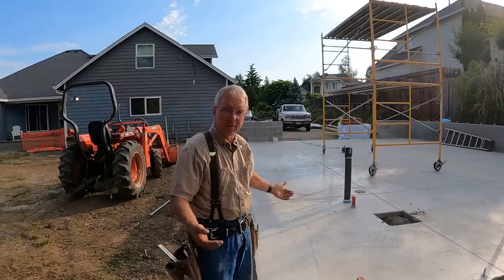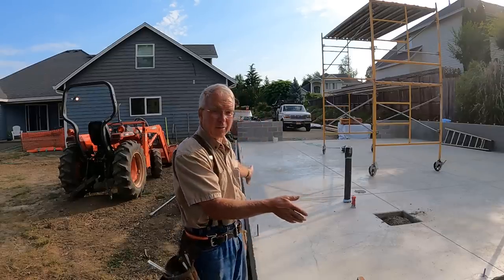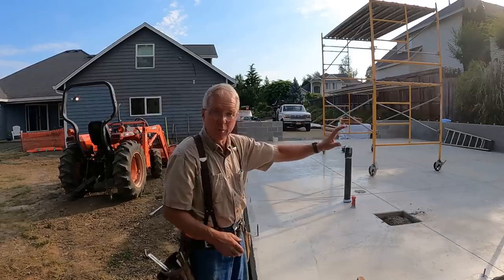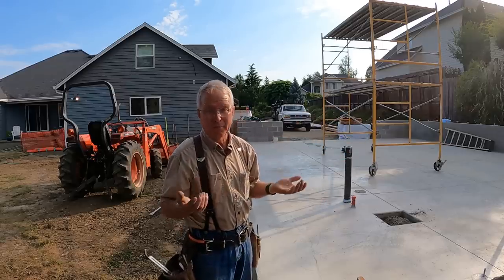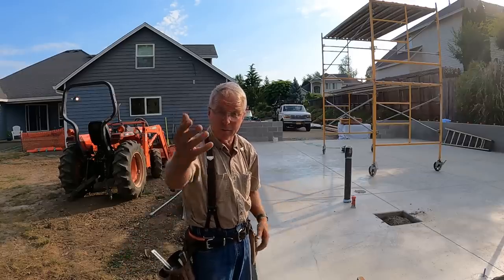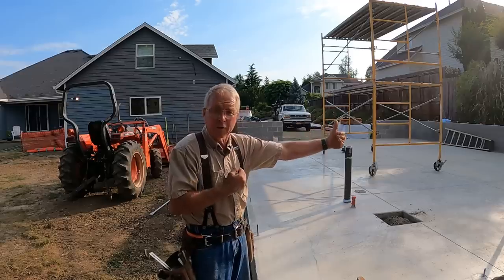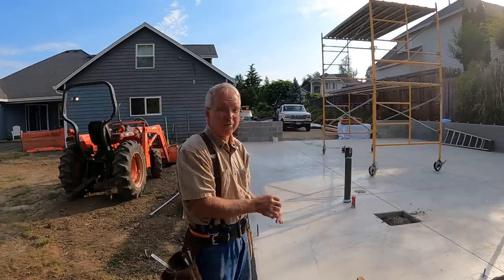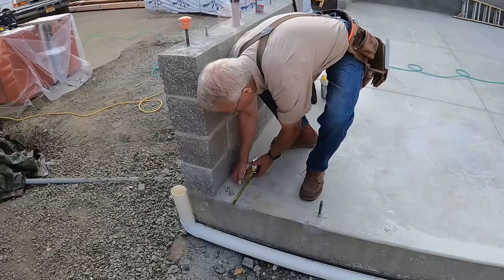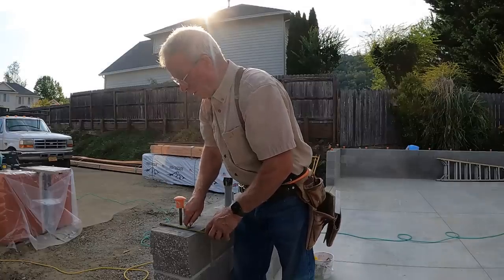Gonna snap out the perimeter, 5.5 inches in. This line and the two ends are essentially perfect. That stem wall varies from perfect to 1/4 inch out. Okay, my bad. But I'm not a mason, I already told you that. So anyhow, we're gonna snap this out, we're gonna make these side lines perfectly parallel. The end is square, so we have very little to figure, we just need to make our 5.5 inch marks, pull the chalk line, pop it, and get to work.